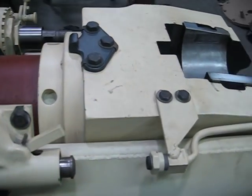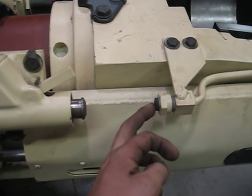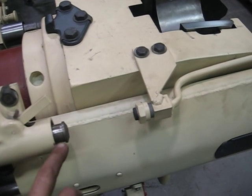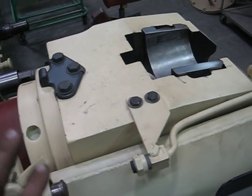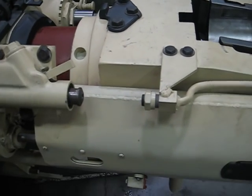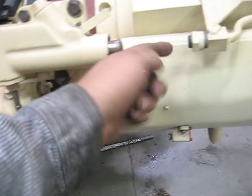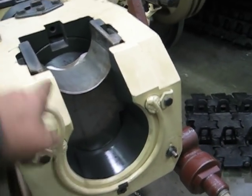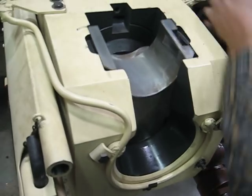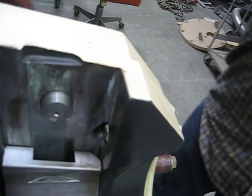The gun is recoiled a bit here, but normally this valve rests against the end of this tube. This is part of the air pressure system that helps blow fumes down the tube when the gun fires. It hits this valve, and there's air coming from the air compressor that pressurizes around the backside. Those holes go through here into the breech assembly and help push the fumes out the barrel.